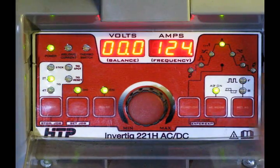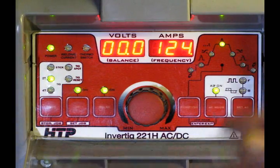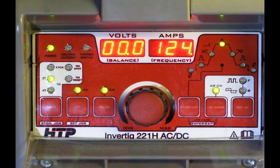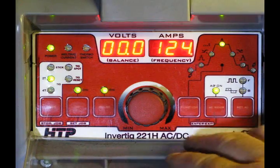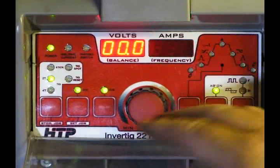What that does is when you activate the pedal on this machine, gas will begin to flow for two seconds before the machine actually lights up. So sometimes if you want to purge your area of any external atmosphere and get that good argon shield going, you might want to set your pre-gas up one or two seconds before the torch actually lights up. You can also set post-gas.